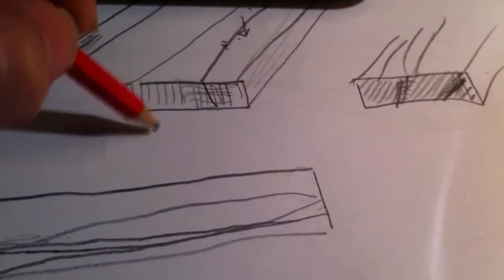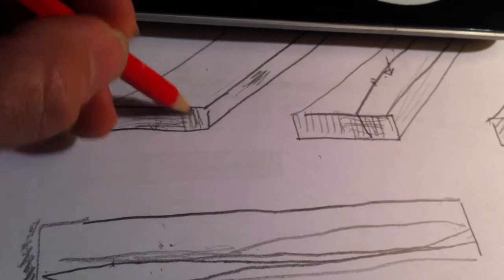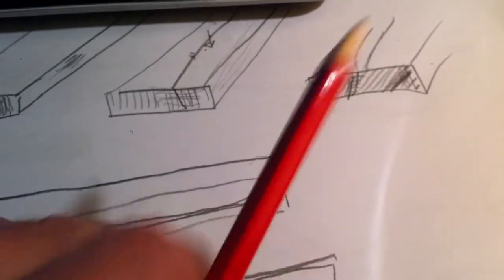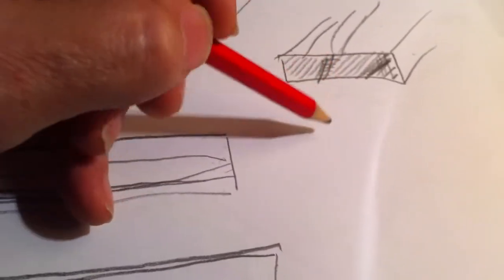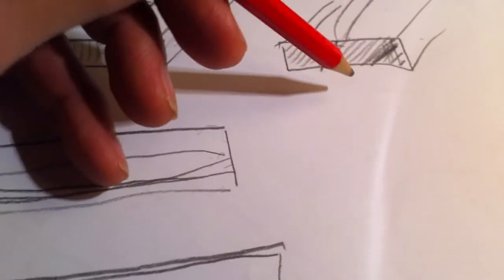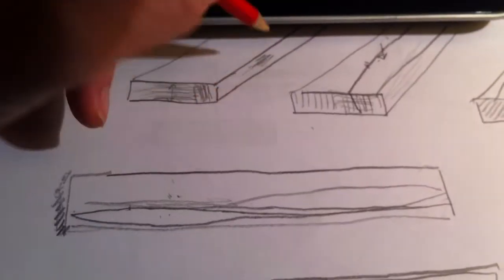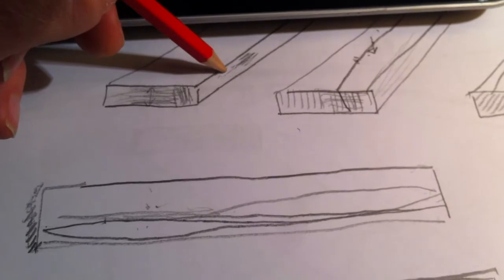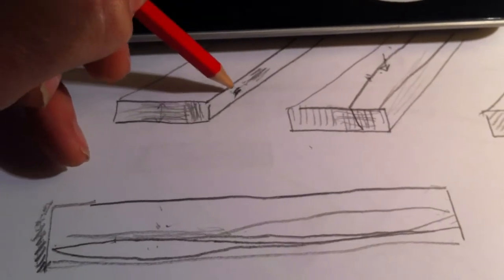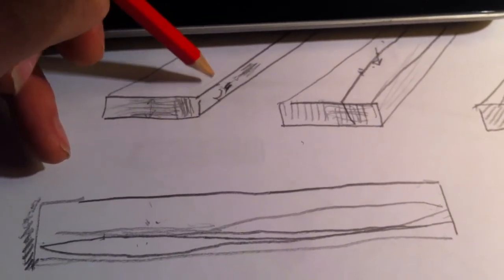Okay, and the last thing I wanted to say is that in either case, if you use this system, or this system, or this system, you want to strictly keep track of every rib that you cut, in sequence, like number it somehow. After you cut the rib, mark the number and the side, and always make it consistent. Put the number on the same side. So if you cut from here, put number 1, cut it off. Next one, the same side, number 2. Next one, same side, number 3.